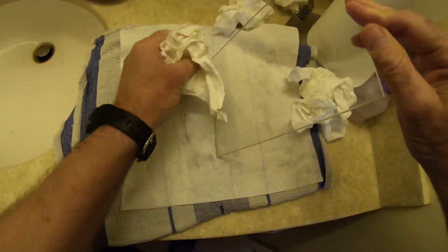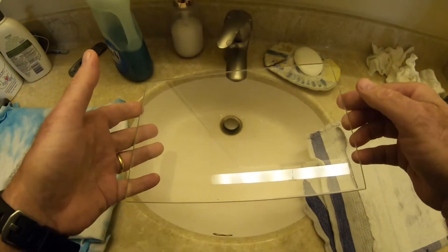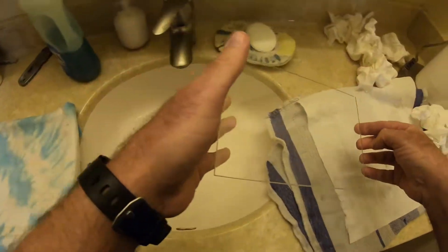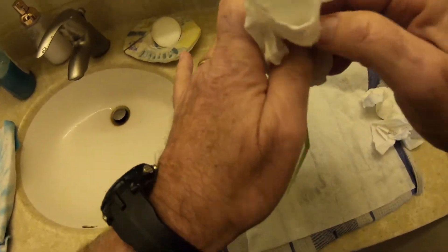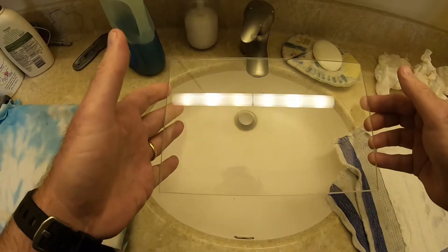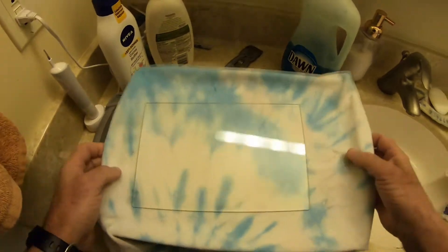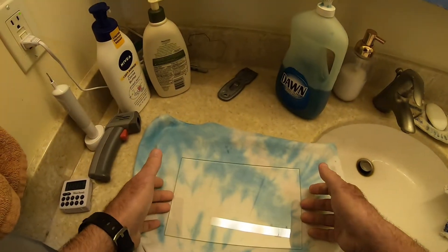The back side doesn't seem to do it as much. As far as I know, I'm only printing on one side — I could print on both sides and alternate, but it's working for me so I'm sticking with one side. That got off most of the water. To get the rest off I use another dry clean paper towel — I'm reusing these, not throwing them away after each use, since this is super clean already. Then I hold it in the light to see if there's any residual or filament remnants.